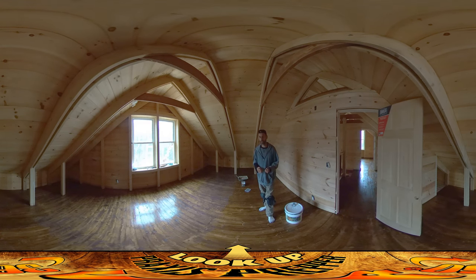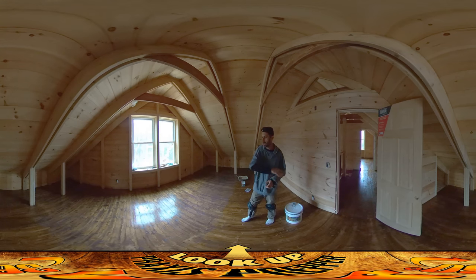This is the first time you've seen it since I added that second coat of stain. First I did a pass of dark walnut stain, then wiped that all down to really get the grain of the wood showing, and then I did a second thin pass of a golden oak stain to bring some of the more orangey colors out of the wood.